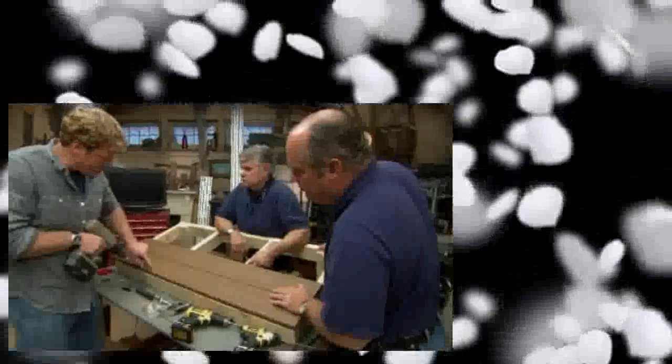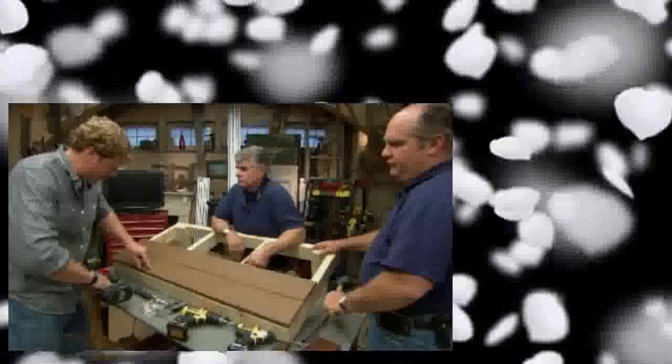it'll sink itself, bottoming out just at the right height, and actually the screw makes a bung hole all by itself. Now they sell the screws with bungs that are cut from the material of the decking. Put those in there and send it home. Beautiful. It's pretty good looking. Now these are meant for composite material, not for wood.